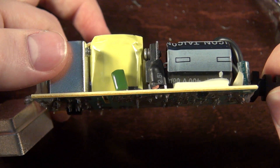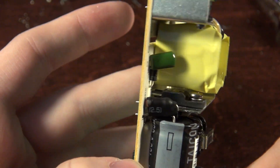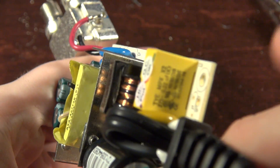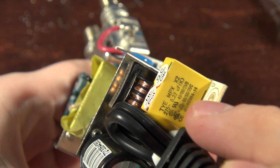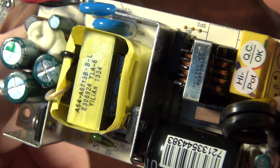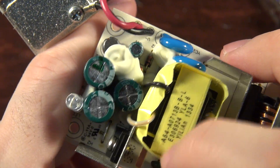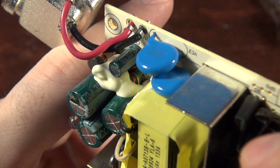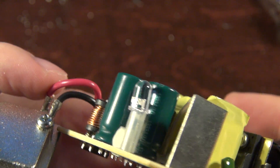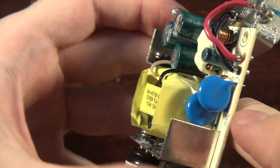400 volt cap. It's a Ticon cap — maybe 68 microfarad or something similar. Here's our choke, and this must be the suppression cap: 0.22 microfarad at 275 volts AC. The filtering choke doesn't have anything useful marked on it. There's a transformer — it's a Yai Lian brand, I think I've seen that before. The output caps are nice green ones, looks like Ticon. They appear to be proper 105-degree-rated capacitors, which is good. Plenty of filtering across the transformer with MOVs.